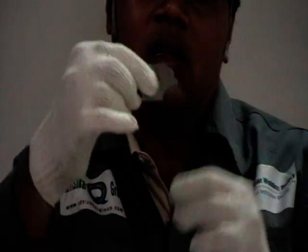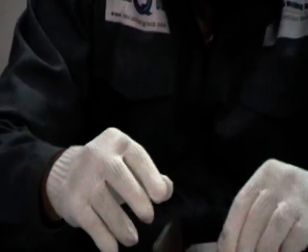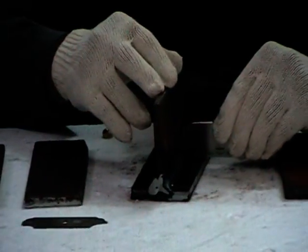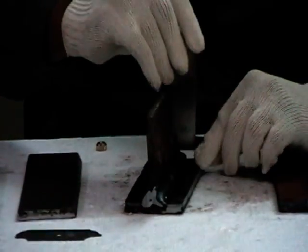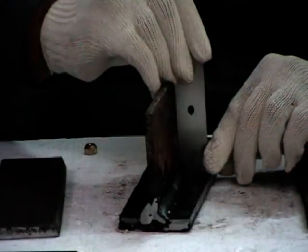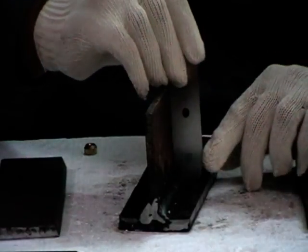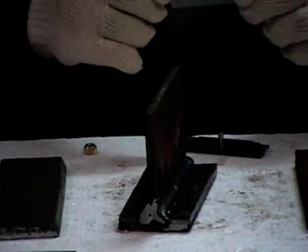You can see here it is mounted — it is a 12.7mm concave fillet. Likewise, we can also measure a convex fillet. For measuring a convex fillet, we have to use the convex side of the fillet gauge. I am taking 7.9mm as a reference. Here I am getting a leg length on the vertical axis as 7.9mm. I am turning the fillet gauge — this fillet is also 7.9mm. So it is a 7.9 by 7.9, approximately 8 by 8mm convex fillet throughout — a convex fillet of 8mm by 8mm leg length.